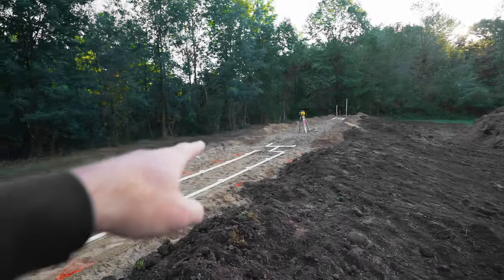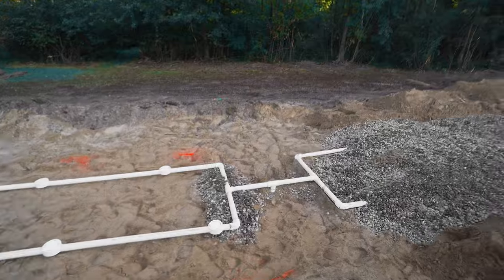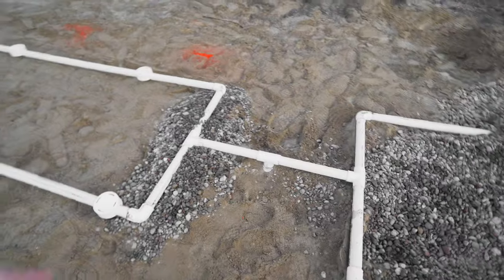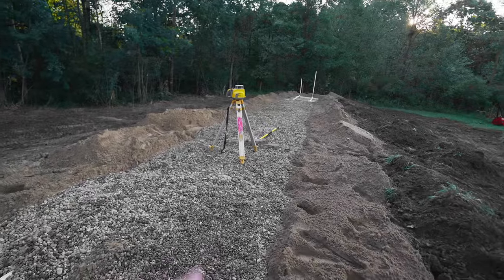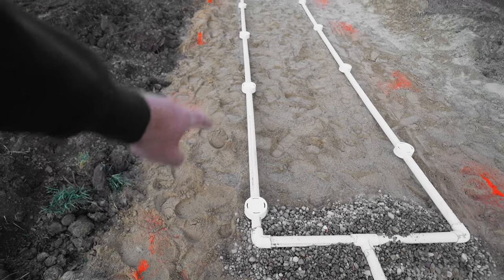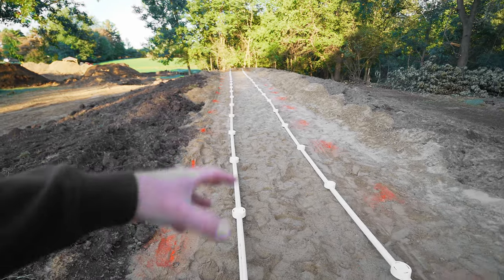The pipe runs along behind me through here and then we've stubbed up this pipe in the center of the mound. That pipe goes down about five feet from this point, and that's where the water comes up into the field. It tees off and splits into two runs — one going each way. These little discs along the pipe have been drilled out so that water will spray, and the disc keeps the stone off the hole so the water is able to disperse within the field.